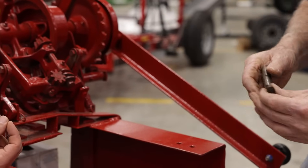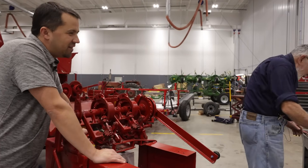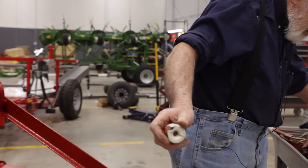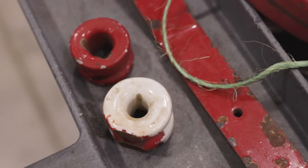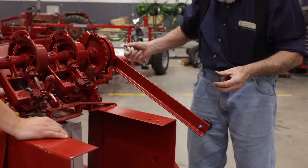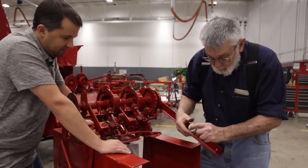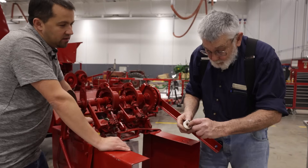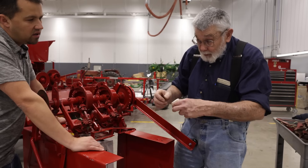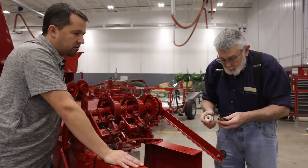It's interesting that something as simple as twine rubbing across metal causes that wear. The other thing is: on the old ones they used porcelain, the newer ones use metal, but the twine comes through guides — one out on the needle yoke, one where the twine comes out of the twine box, one right in front of the needle tip. Over time, it'll start to wear grooves in those. Especially if you're switching balls where it's tied together, that knot will catch as it comes through and cause a mistie.